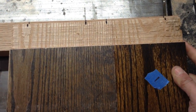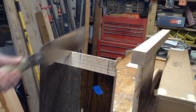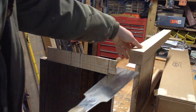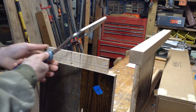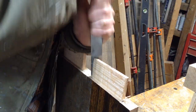To get the marks for cutting these out, I'm just lining them up with the mortise holes in the top of the piece and using a sharpie and a straight edge to carry those lines down to the side. This could probably be done faster, but for this I decided to hand saw. It's not necessarily difficult to learn how to saw straightly and accurately, but it's something I don't mind practicing because you can always get better at it. So little projects like this that could be cut on a machine, sometimes I choose to use the hand saw just to keep in practice. Then I could drill a hole in that center piece and use a coping saw to knock out the excess.